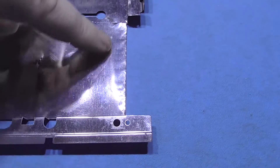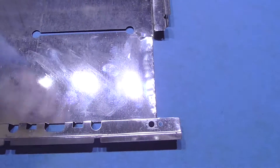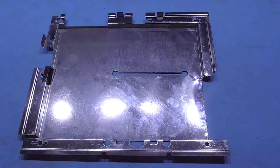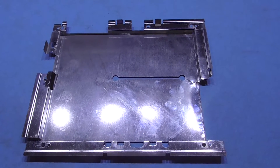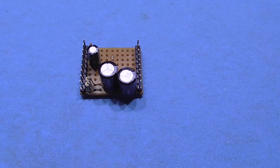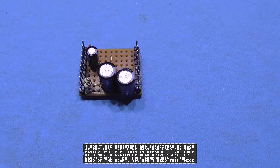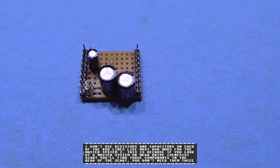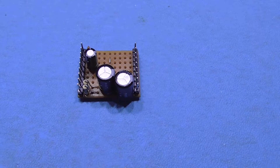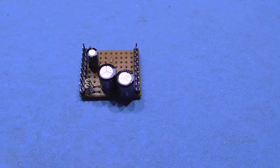As you can see I've finished cutting the shield away. I'll put a bit of black electrical tape along the edge just to stop the wires rubbing against it when I put this thing back together. I've also finished building my circuit. I sat down and looked at the original Master System schematic because I wanted to get as close to the original Master System video output schematic as possible, and I came up with this little circuit board. I'll put a picture up of the circuit board and how it's wired, and I'll show you how to make it out of vero board.